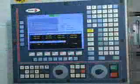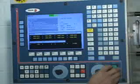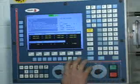Our 14 inch machine comes with 4000 RPM, 7.5 horsepower, and a 2 inch through hole. Our 18 inch heavy duty comes with a 10 horsepower motor and a 3-1/8 inch spindle bore.